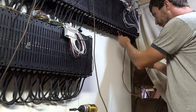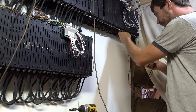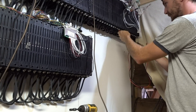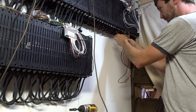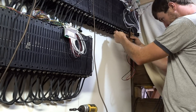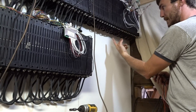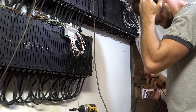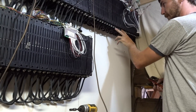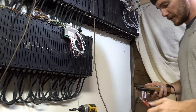The two center ones have 66 volts — those are my two. And these two other ones should be zero, because these are the ones that are paralleled together. See, these are zero. So I've got to put a jumper from here to here, and that'll be my main jumper for putting these two separate packs in series so the current will flow through the big jumper wire instead of the small balance lead wires.